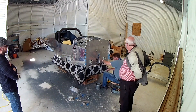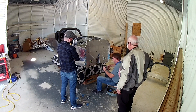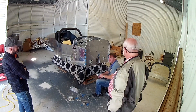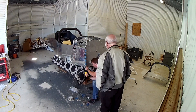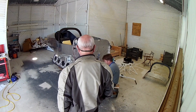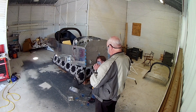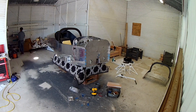The idea of putting it up on this table was to put the landing gear on, and things have to go in a very specific order. To get the main gear on you have to have the front gear on, to put the front gear on you need the engine mount on, and to have the engine mount on I really want to have these cam locks done — at least the ones around the lower and sides of the firewall. So we're doing that now as the final securement. All I've done is countersink some pieces of metal and rivet them on to the side of the fuselage at the bottom.